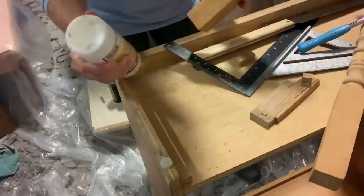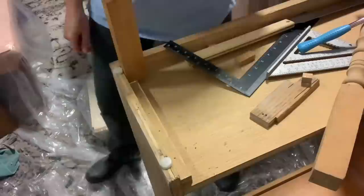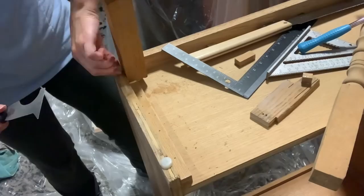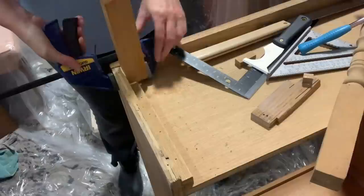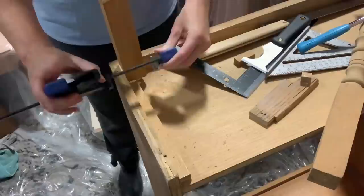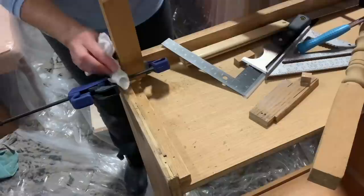I'm gluing around all of the edges — I want to make sure I get as much contact as I possibly can because end grain isn't that strong of a glue-up. I want as much surface area of glue wherever I can. I'm removing this old peg since I won't need it. I'm going to let this glue sit up for a minute before I do my pocket holes — it'll just help them be a little more sturdy. You can of course do pocket holes first if that's what you want. I always have my baby wipes on hand and I'm wiping off the squeeze-out.